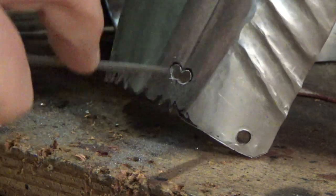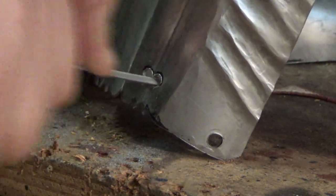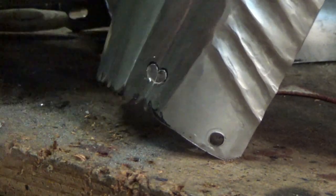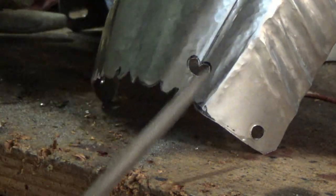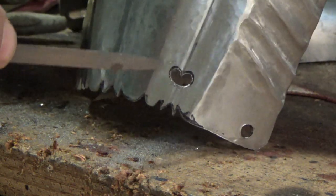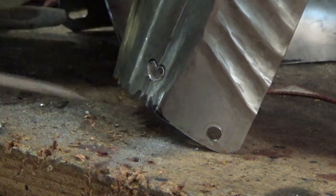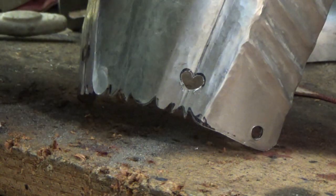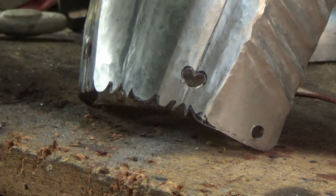Now I'll take this one — it's a bit elliptical — get it in there and take off this bottom part. There you go, you can see it's starting to come together. I've got a broad triangular file here. Feed it through the middle, looking at this top part — that's my registration for the center. Make a couple of cuts just to start the movement off, then tidy it up with a sharper triangular file and you're done.